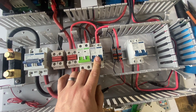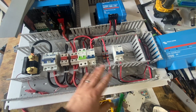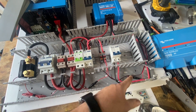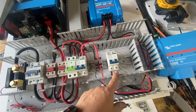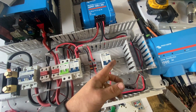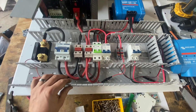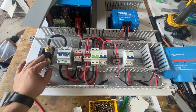This one isn't solar — this is for DC main, and then this one is going to be solar. The way these industrial panels work is incoming power comes in from the top and outputs out the bottom. In this case we're doing a slightly unconventional thing because of how the output routes here. We're trying to follow convention while being pragmatic about it. I wouldn't say this is perfect necessarily, but we're learning more about it.